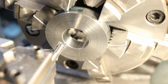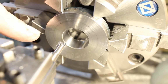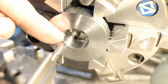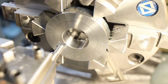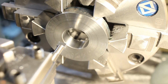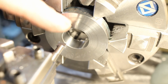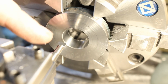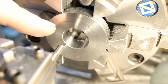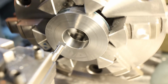And that was a dry cut without lubrication at 0.1mm depth of cut. These small boring bars without a chip breaker or positive rake tend to produce a very stringy chip. In this case it went into the spindle bore and just migrates to the other end. With large depths of cut, these tend not to work very well. But that's not their main purpose, because they're for small diameter work, for precision work. And as you can see, the finish in the dry state is even better. Very, very good finish.